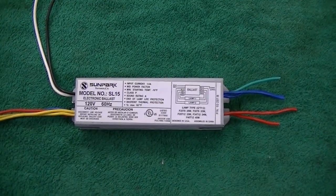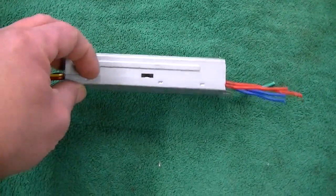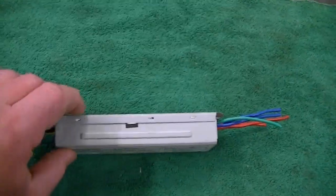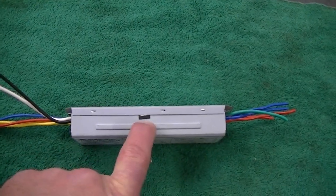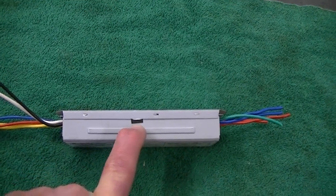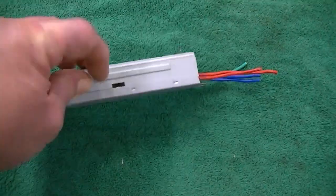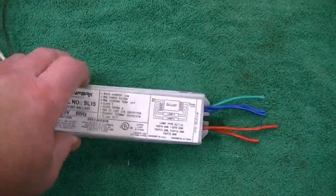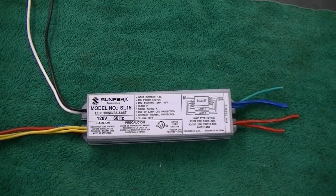It's going to take me a while to get this actually pulled apart. You can see it's got a lip here with kind of interlocking tabs. I've actually disassembled one of these once before — I know there's a transistor here and another one clipped on there, and they're using the case as a heat sink.